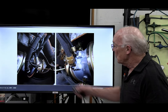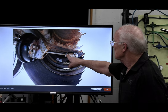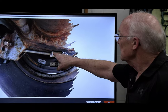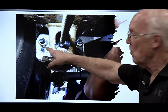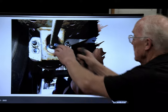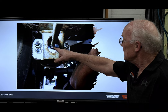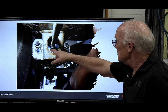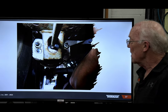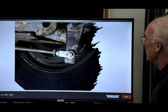So basically, it got put on the wrong side. Same vehicle. Look over here. It's touching. You know what the problem is? Somebody changed the chamber. You can see the old markings over there. And usually you have a provision that you can do this because you want to make sure this is lined up in there. Because over here, of course, there's a slack, and sometimes you make a catch over here, and you're looking at the push rod, it's all worn. So this is the kind of stuff that happens out there.